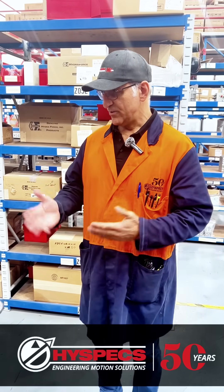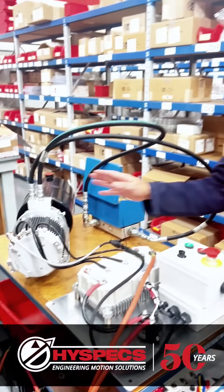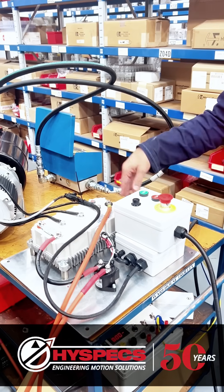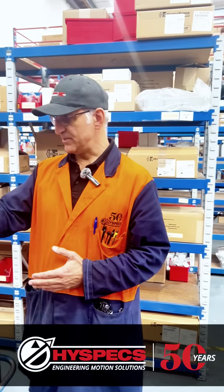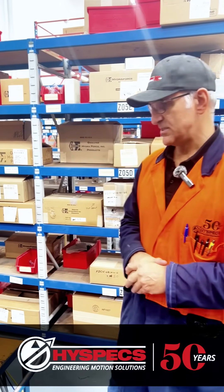This is a solution we have been selling since 2023 and we have all the components in stock. The solution is available and ready to sell — it's scalable. This motor and controller can provide starting from 2.5 kilowatts at 24 volts, and by increasing the battery voltage you can reach up to 6 kilowatts. We have sold it mainly for 36-volt and 24-volt applications.